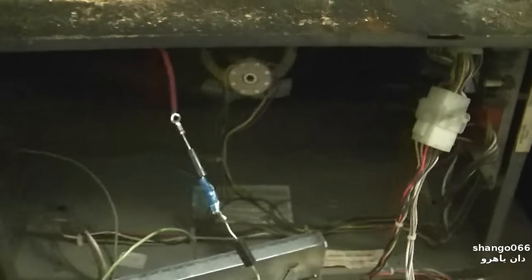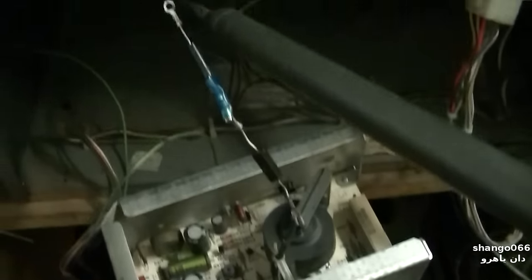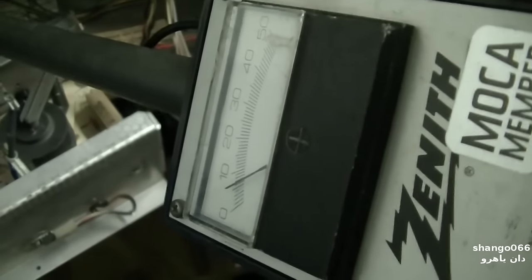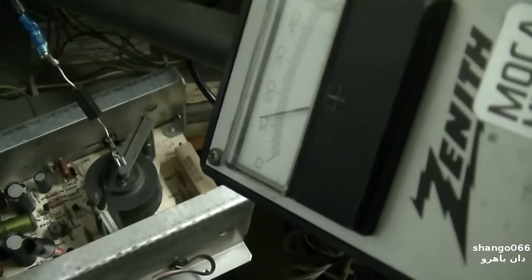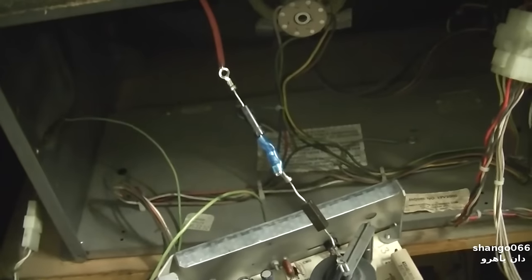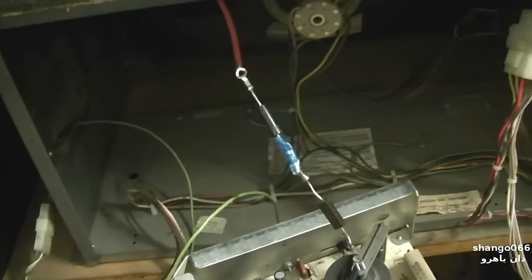The CRT is not lit at all though - I wonder if the CRT is open. There's 12 kilovolts - that's well under what it's supposed to be, but that should be enough to make an image, and I don't see the CRT glowing at all. I measured this before and there was no high voltage. I measured it with this thing. I know for a fact there was no high voltage.